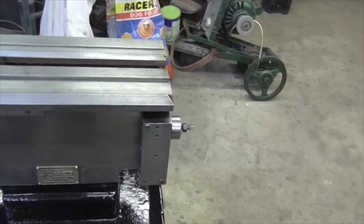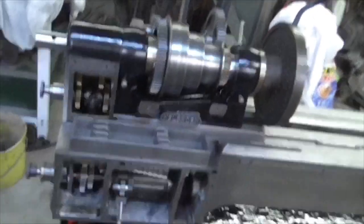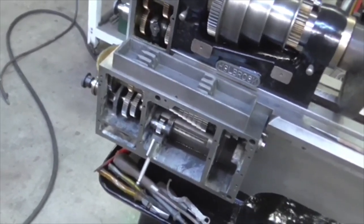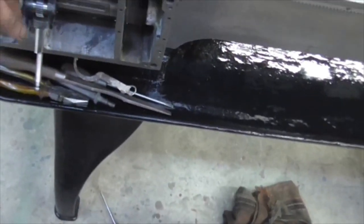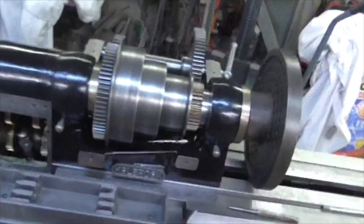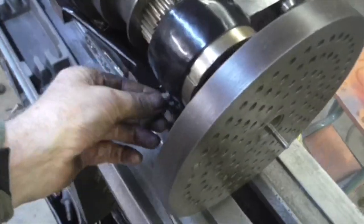Hi folks, Monday, four o'clock. I cleaned that bit up and put it back on - this is the patent device that takes the end float out of the lead screw. I put that back on as well. I've had the spindle to pieces again and readjusted it and I think it's freer. There's still that initial stiction when it starts moving. I've had the air drill driving a piece of rod round in a collet, and it's very free.